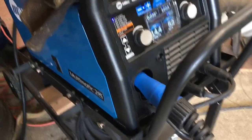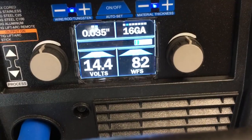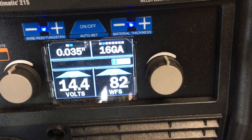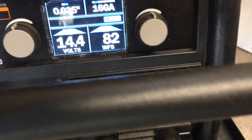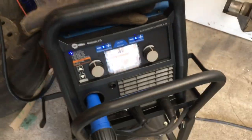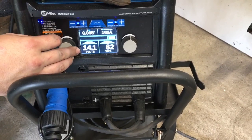Here's his new toy that he went and got yesterday. He's liking the simplicity of it, how easy it is. It'll go 110 or 220 — 120, 240, whatever you want to call it. You just click buttons and it pretty much senses what you're doing. You put in what you're doing, the thickness of your metal — 16 gauge, whatever — and it puts the settings up there for you. That's pretty slick. I tried to play with it yesterday after he left; it was different, not what I was used to. But you can still change the parameters — say it's 14.4, if you want it harder you can change it.